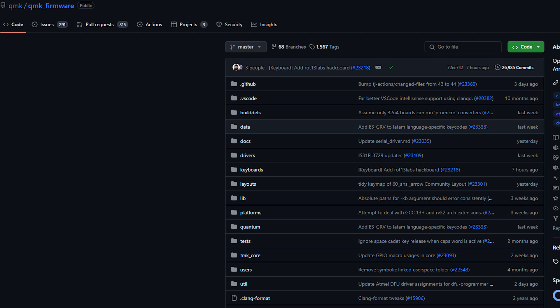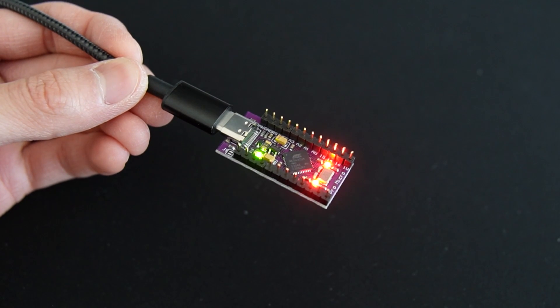As I mentioned before, the microcontroller is the gigabrain of the keyboard, but right now it is dumb as hell since we didn't install any software on it. To do that, we need to actually create the software by using the QMK firmware GitHub repository and configuring it for our microcontroller model and keyboard. It is pretty similar to Ergogen in that you basically just need to fiddle with some configuration files — this generally involves defining the matrix pins and the layouts of the keys, and then building the firmware using the README instructions. There are a lot of resources online that explain and walk you through this process, so I'll link those in the description. Once I built the firmware, I flashed it onto my microcontroller and then waited for my stuff to come in the mail.